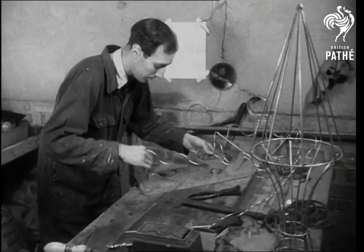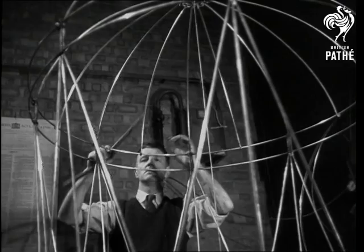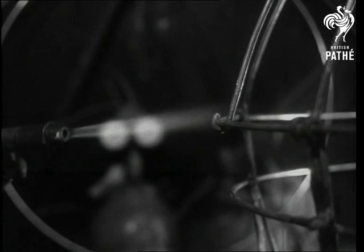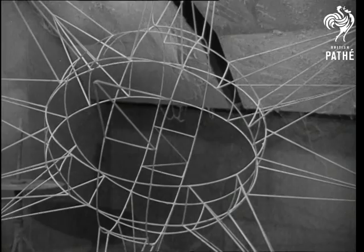After the wire frames have been bent into shape and welded together, a new process is applied at this Berkhamstead factory, which is already attracting many dealers from overseas. The process is based on nature — on the way in which a silkworm protects its chrysalis. Liquid plastic is sprayed onto the frames until a cobweb covering is obtained, the mesh being built up in strength according to size and requirements.